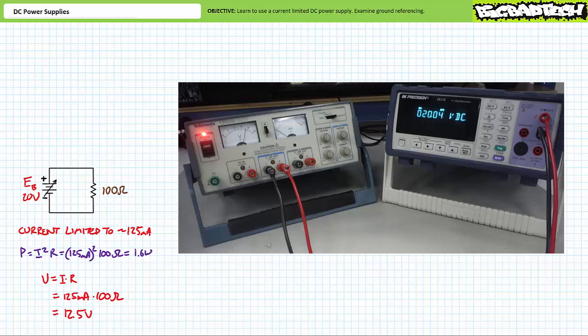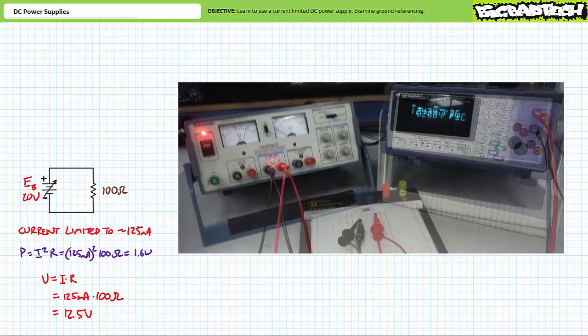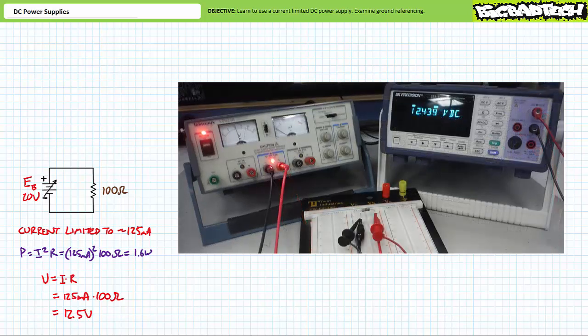And additionally, beyond actively controlling the output voltage, we should see the power supply throw a red flag in the play and indicate that it's in an overload condition by illuminating the overload LED for source B. Let's see if this is the case. As we anticipated, voltage drops from 20 volts to roughly 12.5 volts as current pegs the user-adjustable upper permissible limit of 125 milliamperes. The overload light illuminates, indicating we're pegging the limit.